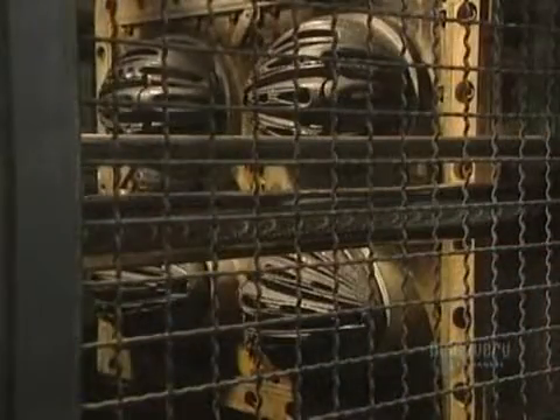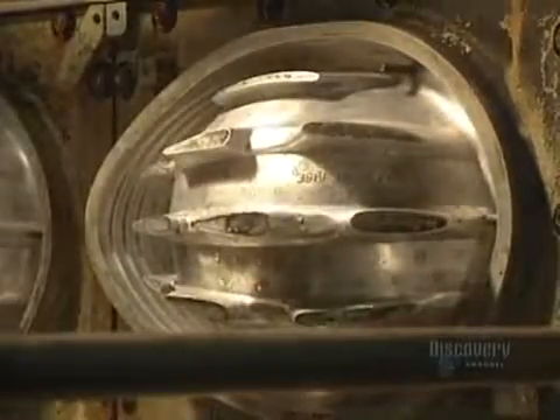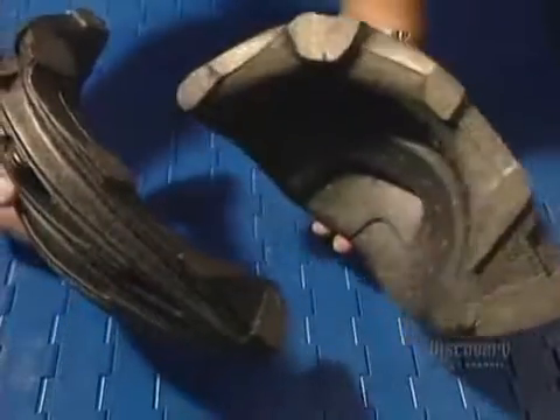The contents of this bin will produce about 20 foam pieces, which will take shape on these molds. The press closes up for the six minutes it takes to mold four foam pieces. The particles fuse with steam before being cooled with water. The foam is removed from the mold — forms are produced for different helmets. Fusing of the particles has welded the granules to one another.